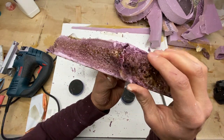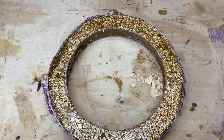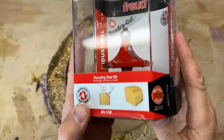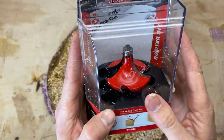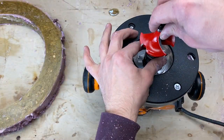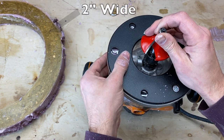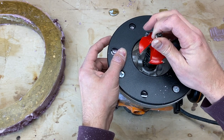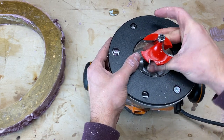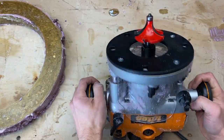For routing I bought a one-inch round-over bit — a massive bit because we have a two-inch wide section. If you route both sides you get a perfect rounded circle all the way around on all four sides. One thing to account for: with a bit this size, you need a half-inch shank to accommodate it.